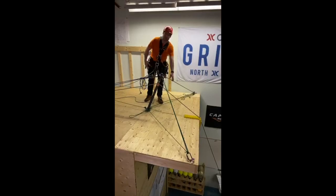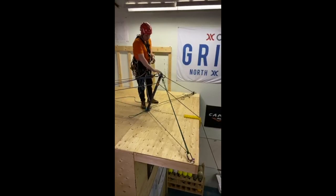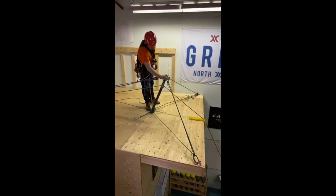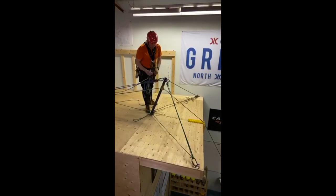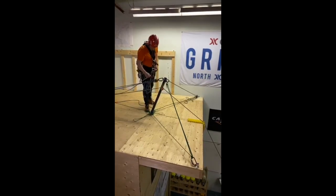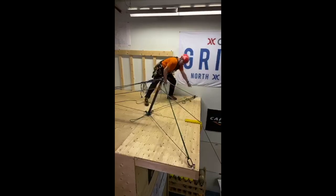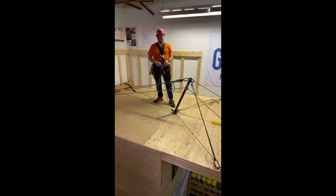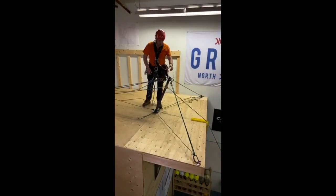With tie-backs, front ties, and back ties we don't need more force than we can put in by hand. What I've done is tied the rest of the ties with a length of 7-millimeter cord hard-tied into this carabiner. There's a non-working 3:1 here — we gave that some hand tension, got this in the position we wanted, and tied it off with a pull hitch. I then used the remainder of that cord, brought it back to the foot of the tripod, hand tension, hard tie, looped it around, tied it in here, out to this anchor, hand tension, tied off, brought it back, and tied it off with hand tension to the back anchor.